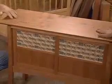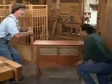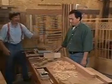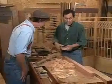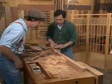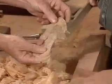And all of the surfaces in my work are hand planed. Planed. All right, so we're going to achieve this truth in the wood. We've got to see how we get truth in the plane. Okay. So maybe we need to move to the technique. Let's start with looking at the element. First of all, let's look at the technique once again and how you use the plane. The plane is pulled instead of being pushed. This is set for a very, very fine cut right now. Gosh. That's tremendous. It's like one cell thick. That is astounding. It's very thin.